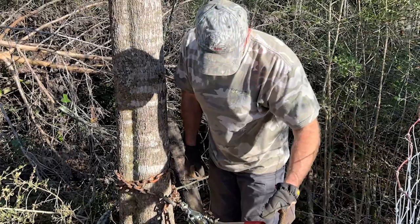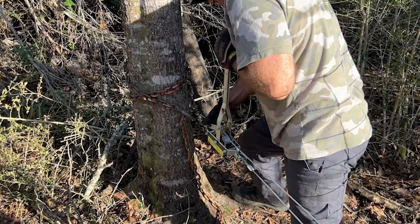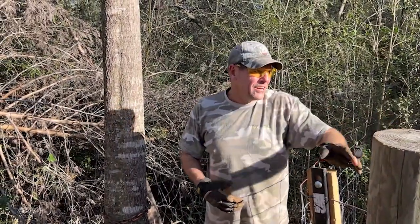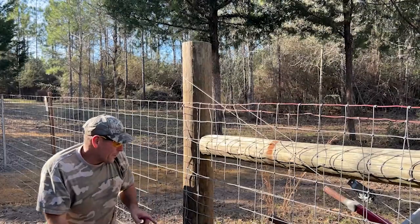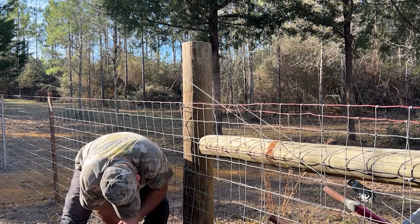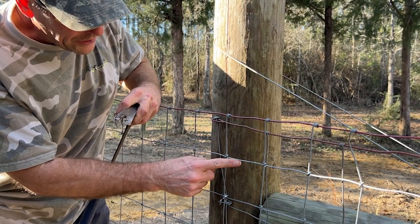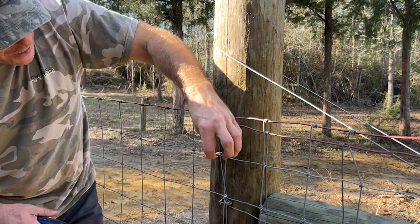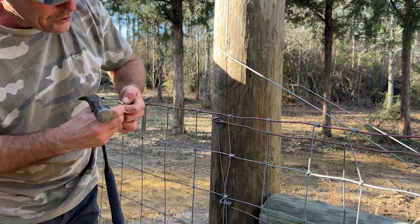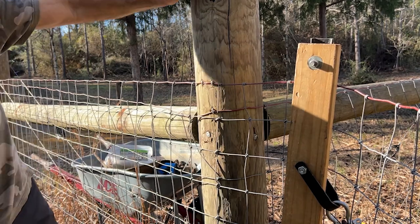Against my better judgment, I'm going to try and get two more clicks of tension before I staple it off. There's one, there's two. That's tight — I can hear it biting into the oak, and I can feel it. So that's tight, and we're going to go ahead and staple that off. It's very important that I get these staples in good and straight so that they hold the tension. I don't know whether to put it directly on this horizontal where the tension is or over here — I'm going to put it over here. Leave a comment down below if you think it should be different. Since most of the tension is going to be held by the heavier wire on the top and the bottom, I'm going to put two staples on that one. Last staple is in.